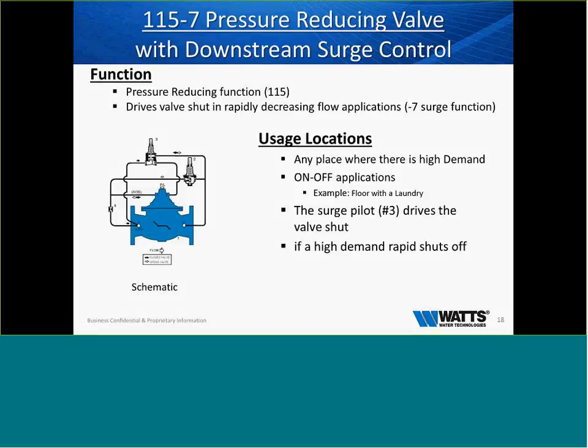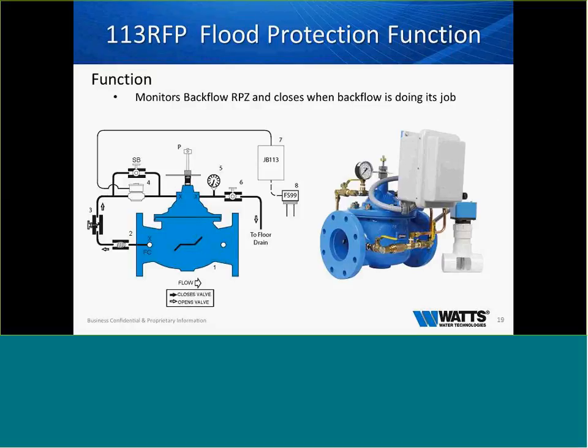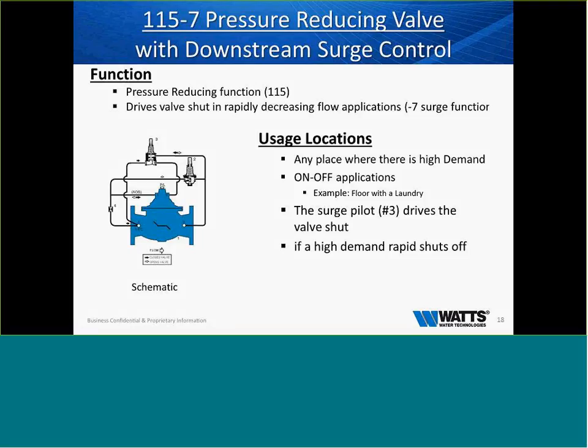And when we have that surge or that transient, it's very detrimental to everything in the building, including the ACV. So I'll give you a quick story about that. San Antonio Water, we were at San Antonio, and they had 24-inch pump control valves, and at loss of power, they were having a surge, and when it left the plant, it was leaving at about 460 PSI. And when it would come back, it literally would take a valve and shatter it into pieces.